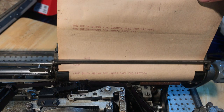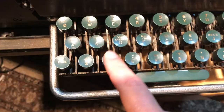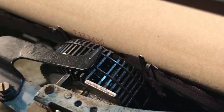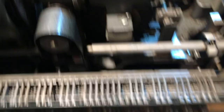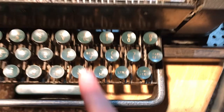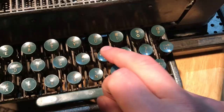Now I want to test the other functions — I want to make sure that the figure shift is all working, so we need to test if we can print all of the numbers and symbols. Let's turn it on. Good, it's gone into idle. Let's put it into figure shift. That's good — we've got all our numbers and punctuation, all printed fine. There are just a couple more functions. We've already tested the carriage return, the line feed, and the space works well. The only thing left now is the bell. We press the bell in figure shift and we should hear the bell — but it's not doing it, so we're going to have to try and fix that.